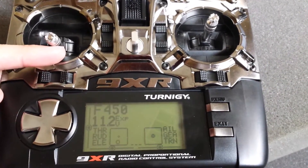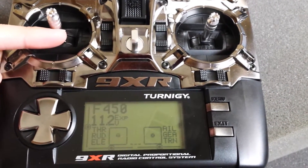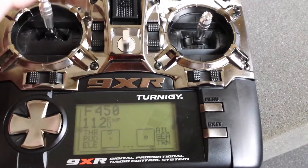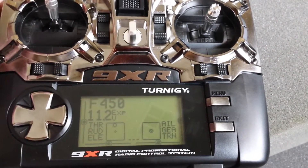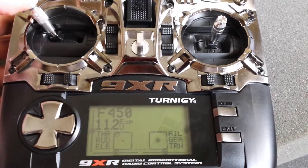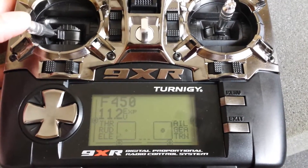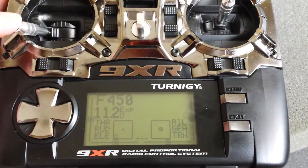As I move the left stick up, it still stays off center until it gets right about to the midpoint and then it moves over. At the top you can see it kind of bumps back to the left a little bit. And this is the furthest I can get it to the top — so not even all the way. If I go far left, stick left and at the top, and I keep it left and slowly come down keeping it left, you can see it bounce way out — the bubble just moves way out. So clearly it's jumping all over the place.